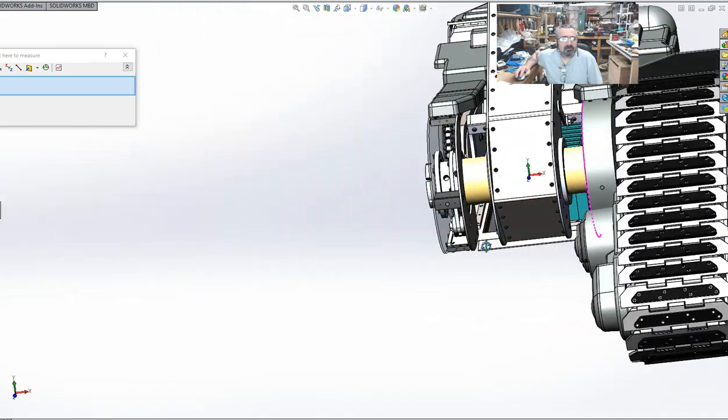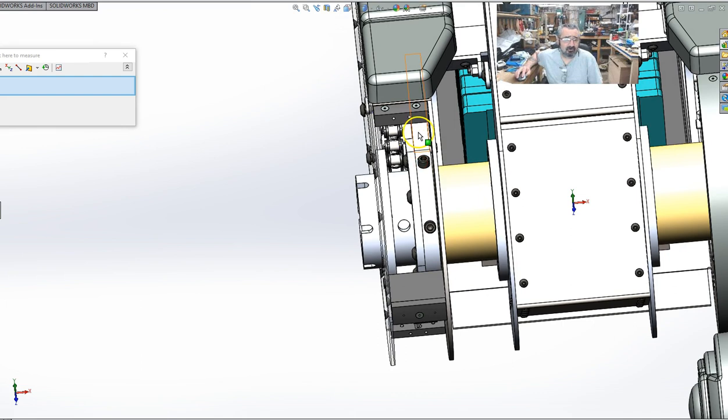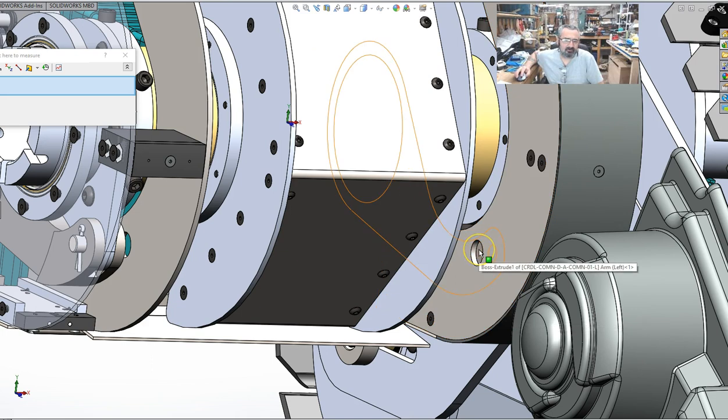But anyhow, my biggest concern is that to squeeze all this in here, we had to offset this arm from this cam. Before it was an inline center, and we can't do that now because it would hit the damn chain. So I had to offset that. I don't know how much torsional force that will generate. I don't think it'll be a problem, but it is a concern I have, and I have kept that in mind. Like I mentioned, G-plates, there's now a hole down here.